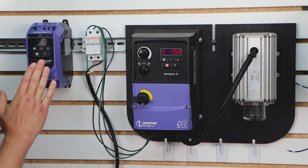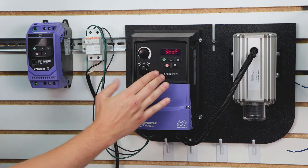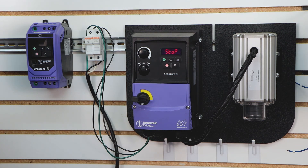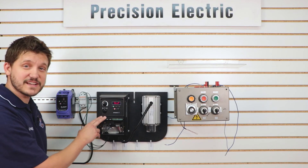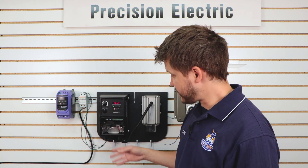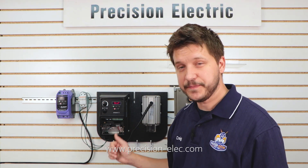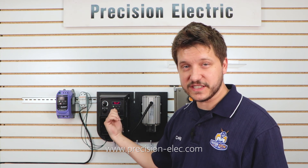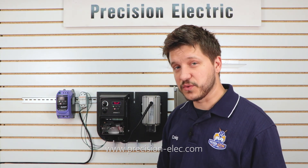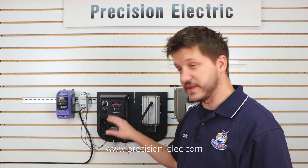In the IP20 unit, you don't have that onboard switch and onboard speed pot, so you will actually have to put a jumper in there for the IP20 unit. So this covers the basic input and output wiring of this variable frequency drive. As you can see, it's pretty straightforward — you're just bringing your incoming power and then wiring directly to the motor. If you've got the NEMA 4X, you can just use the selector switches to get going right away. In the next video, we're going to cover actual parameter setup so that we can run this drive from the keypad. I'll see you in the next video.